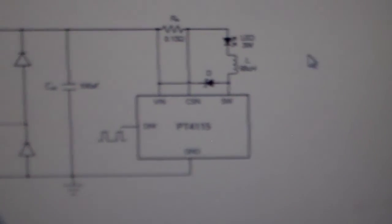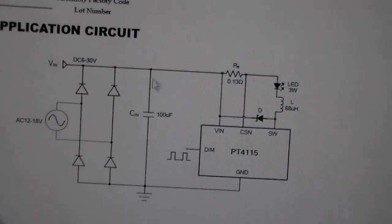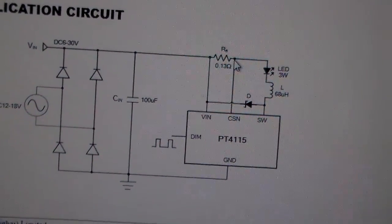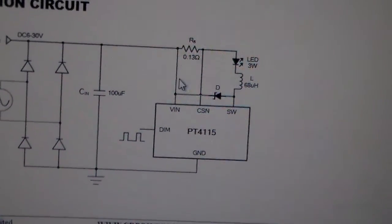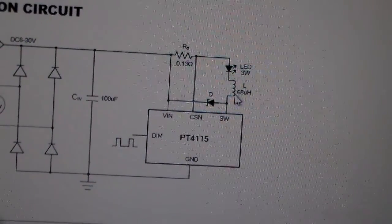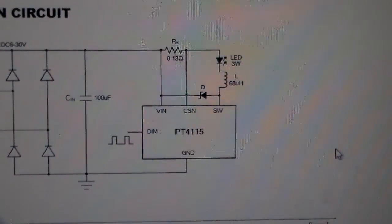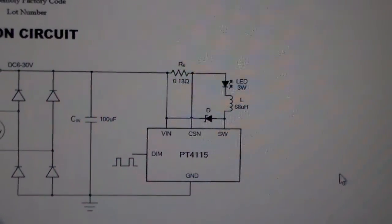So, how this works is basically: you've got your VIN here on a capacitor going to ground to the chip, then VIN to the chip, a small ohm resistor, and then a current sense pin, which measures the voltage drop between VIN and current sense. Then you have your LED, a very small inductor, the switch, and a diode from VIN to the switch. The switch just goes to ground when it's on, doing constant current to the LED.